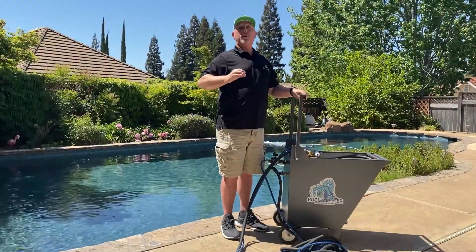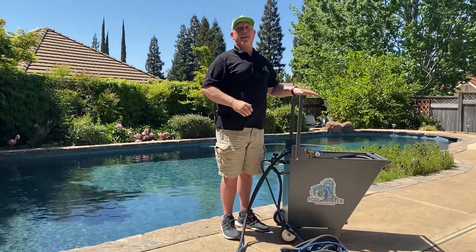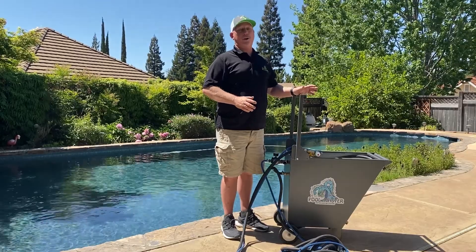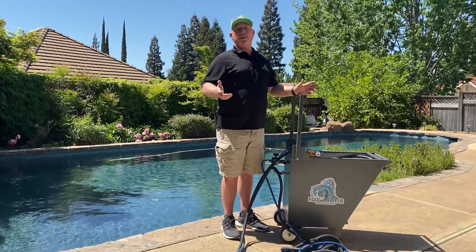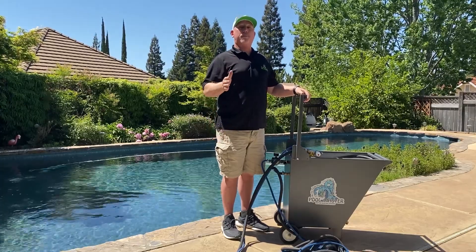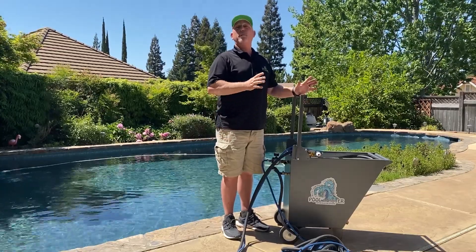With a number four nozzle, you can maintain 110 to 120 PSI. In this tank, with half a bag of media, it will last you 45 minutes. So you get 45 minutes of blasting out of 25 to 35 pounds of media, depending on the job and how hard it is. Sometimes you might need a full bag to get 45 minutes, but that's very comparable to what an outdoor blast pot uses at a much, much lower price tag.